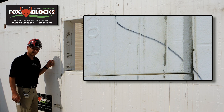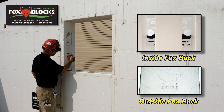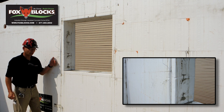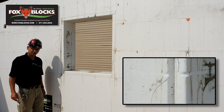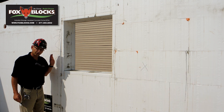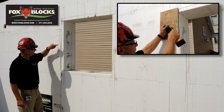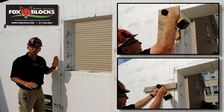Because they had so much to the tie, when they put the vibrator down to get that concrete into these vent holes, that's anchored really good. It worked really well, but they also folded out the block a little bit. So now we've got to do some trimming here to fix that. You could have prevented this if you would just put a piece of plywood up against here and screw right into the buck and into the first tie. That would keep it from folding out, you wouldn't have any problem.